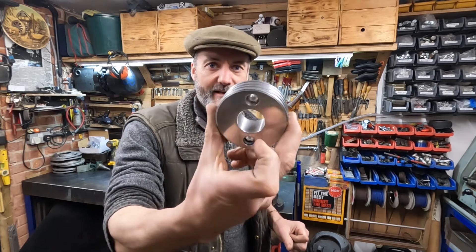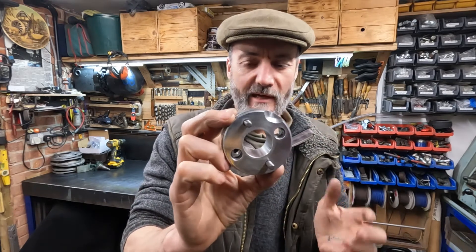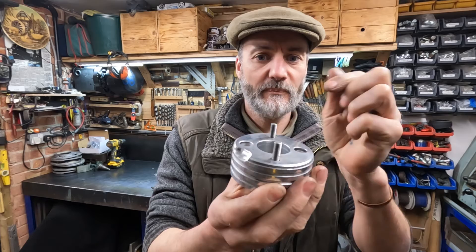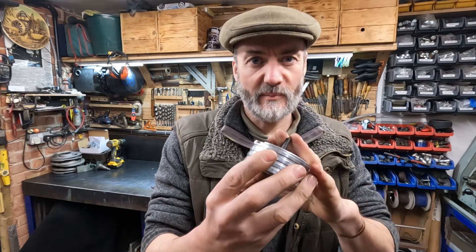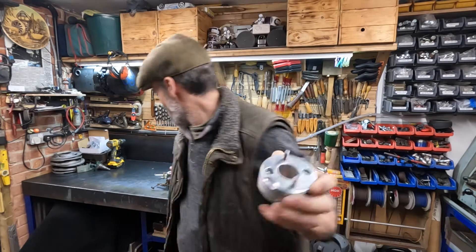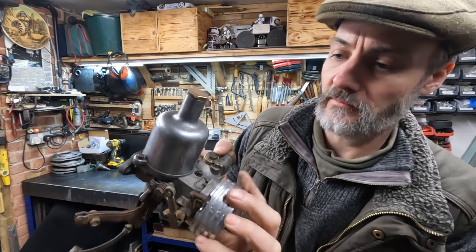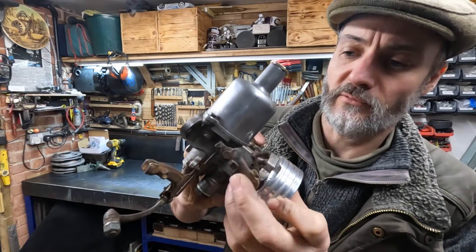So this is the finished adapter. As you can see — well, you probably can't see on the camera because it is that slight — I think it's about a two degree angle on the centre of this to get it from the one inch to the inch and an eighth. The holes have been tapped and these threads have been inserted with stud lock so they shouldn't come out, so you can bolt the carburettor on quite easily. I've done a little relief cut there with the mill and that just takes up this screw here so when it's on full throttle it does actually enable it to get full travel on the throttle.